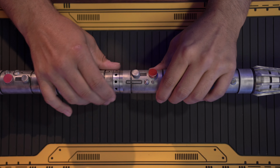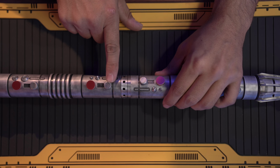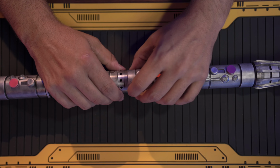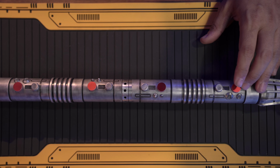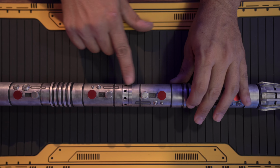So all it is, is move and adjust, move and adjust. See, this is tight and this is still just a little bit past. So we're going to move this back again and move the ring. There we go. Yep, that'll do it. Now everything is nicely aligned here. And again, you can fine tune this little timing shim until your heart is content. It's a little bit of finagling, but you'll get it and understand it after you do it once or twice. You'll think, oh, okay, it's just a ring that goes up and down and that will adjust the alignment of all of this.